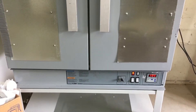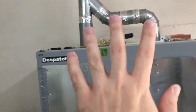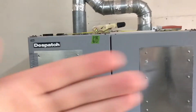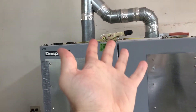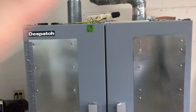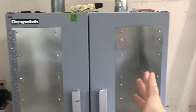The heating elements are at the bottom, and the hot air rises and exits through the top. Polycarbonate manufacturers recommend hanging sheets vertically so hot air can flow convection-style and draw out the moisture — this oven does that perfectly. Some industrial ovens have heat coming in from the sides, which is not going to be as efficient for drying.